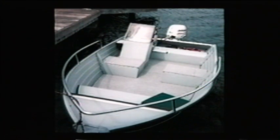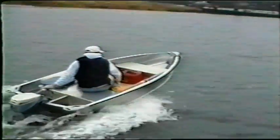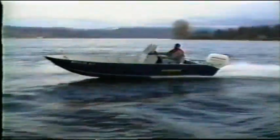An ordinary lightweight riveted skiff will have a relatively flat bottom, as evidenced by minimal deadrise at the stern — that means a hard ride. DuraBoat's curves and semi-V hull mean an easy ride. Combined with lightweight aluminum, this means a boat that will get on plane and stay on plane at lower speed. The DuraBoat performance features mean a boater can choose very good performance with minimal horsepower, or can opt for high performance and speed at the top of the boat's horsepower range.